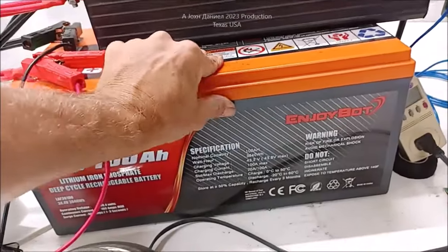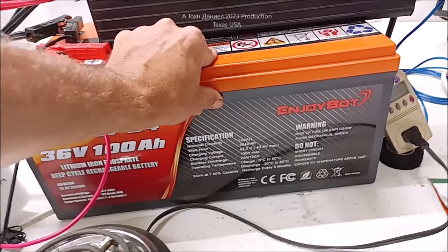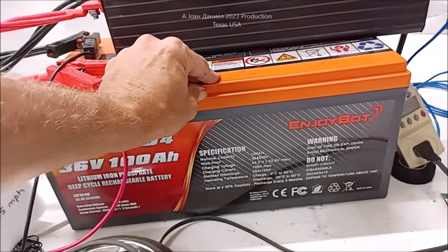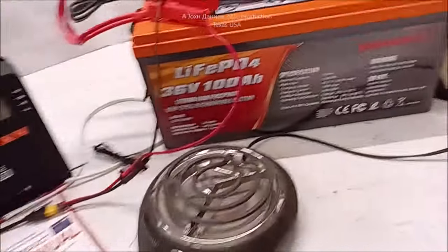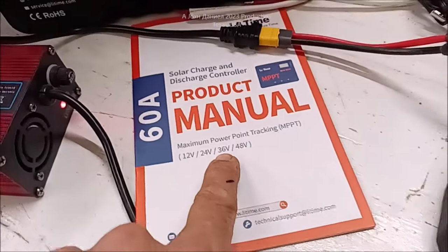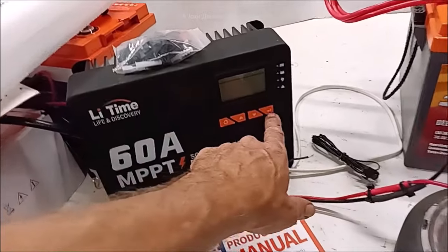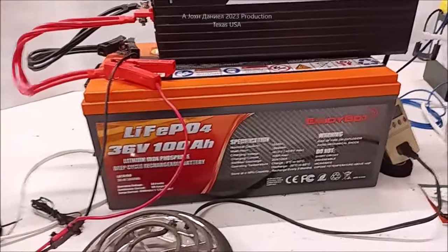What's really shocking is a similar 36-volt battery sold by a competing company weighs pounds less than this one - and another brand called Chins, their 36-volt battery weighs seven pounds less. Why? It's missing something - you'll see in a minute. When you get a controller, make sure you get one for solar that can do 12, 24, 36, and 48 volts - self-identifying. That's why I use the Li-Time; they make similar controllers to other brands but Li-Time has easier tunable software to work with your exact voltage for lithium, and I think it's like five dollars more.